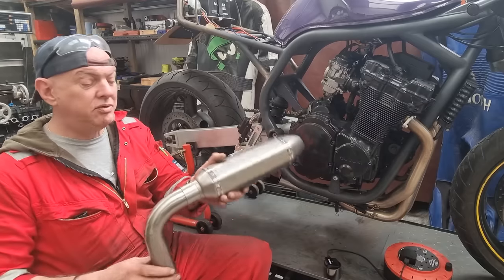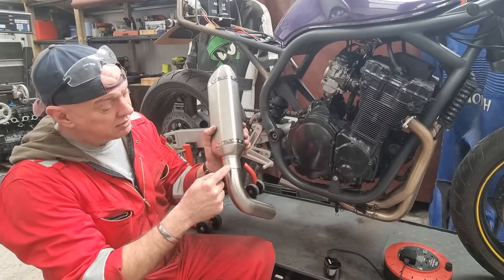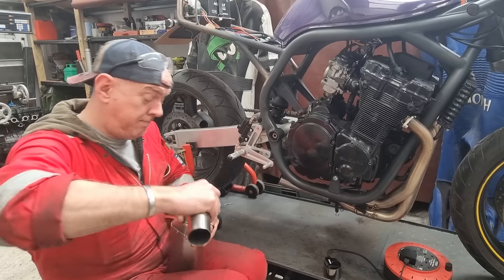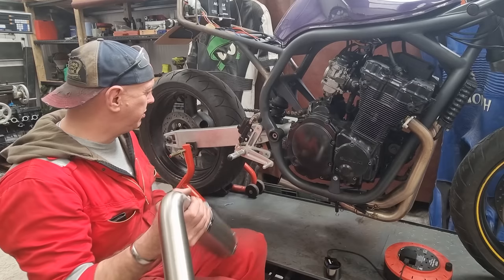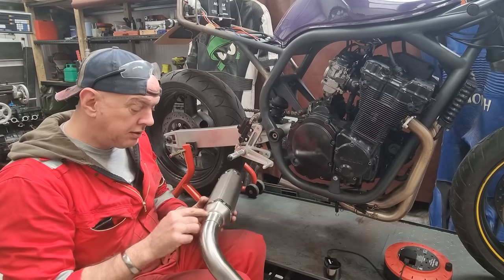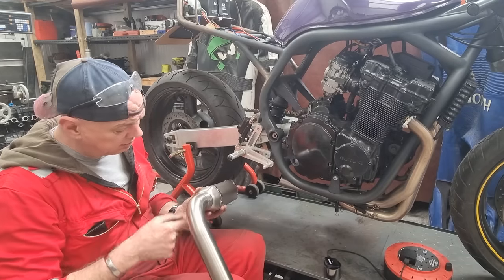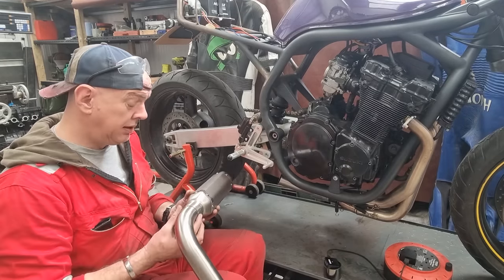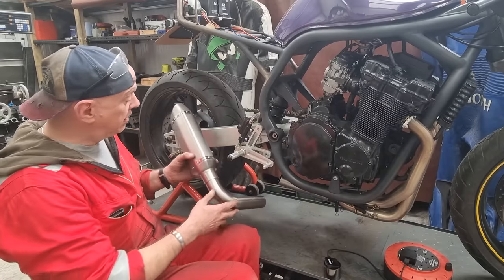So I've chopped up my mandrel bend. I've also had the spring hooks off the end can, and also slit it down here. This is in there properly bloody tight. You have to grunt a lot to twist it, is what I'm trying to say. But those little slits, that's where it's going to get TIG welded over. There is nothing as far as exhaust gases coming back this way out of that joint. That'll be fine, but it'll mean all this is one lump.